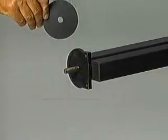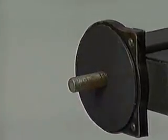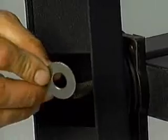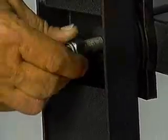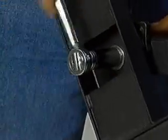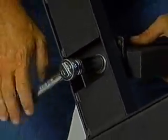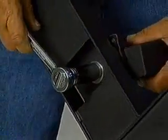During assembly, make sure that the mast rotational bearing is mounted on the mast stud first. Insert the mast stud into the base and place the stainless steel flat washer and self-locking nut on the stud. When tightening the mast self-locking nut, tighten until no rotation can be felt in the mast, then loosen the nut a quarter turn.